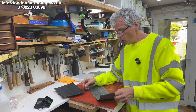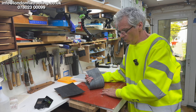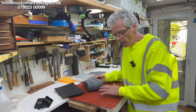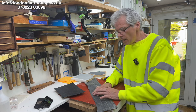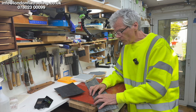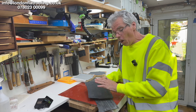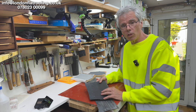When you've applied your glue on a roof and you're out there in the environment and you've glued it all up, once you've laid your EPDM down like this there's no bringing it back up again because you're using contact adhesive most of the time and you've got big sheets. As you're laying it down, if a leaf or something blows in and you go over it, you can see lumps underneath — but they're not detrimental to the system whatsoever. They just don't look nice. With this fleece-back one, you get away with a lot more. So just pointing out why we overlay roofs where possible using fleece-back EPDM.